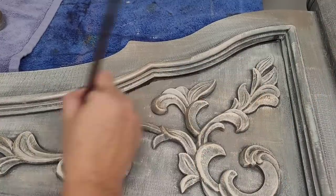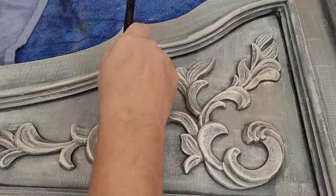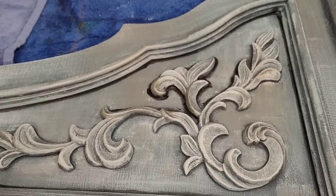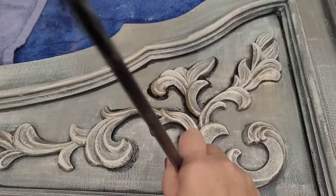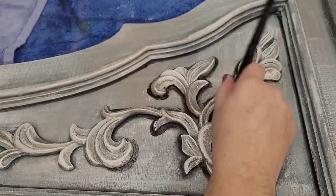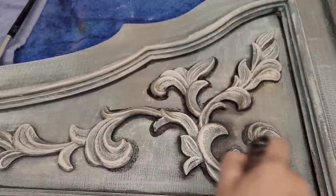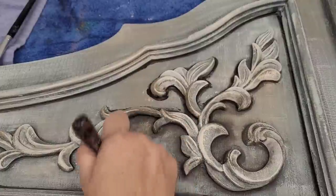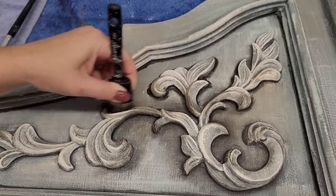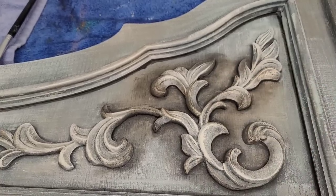Now I'm going to do my favorite thing: detailing with waxes. I've got some dark Metropolis in those crevices but I want to emphasize them further, so I'm using a little bit of black wax from Jolie Paint, applying it with a natural bristle artist brush and working it around the edges of all the moldings. A glaze doesn't give you those soft, smeary edges that a wax does, and that softness was the look I wanted. Once I've outlined all my edges in black wax, I come back with a slightly bigger natural bristle artist brush and smear and smudge it out — I think of it like applying eyeliner and eyeshadow: the eyeliner is the detailed outline on the moldings, and the eyeshadow is the smudging effect that drags it out onto the body of the piece, creating a rich, soft halo around the moldings that really emphasizes them.